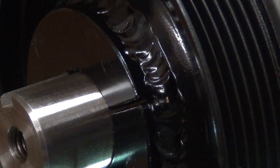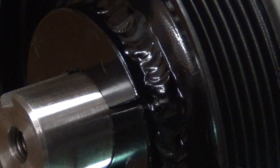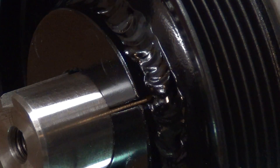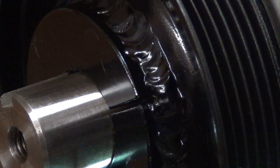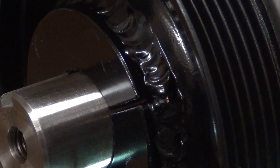The reason this is important: if the pulse is shorter than that 50% duration, then the speed controller may not be able to pick it up at higher RPMs. If the speed controller can't pick it up, it's going to assume the motor stopped because it's seeing a zero RPM pulse. If it's too quick, it may lose track, and if that occurs at a higher RPM, your motor top RPM limit may not function properly. Your controller doesn't think the motor is turning that fast, so it could not prevent it from overspinning and coming apart. In your higher power applications, this becomes really important.